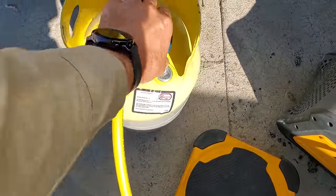Everything is in. We're giving it a good nitrogen sweep, and then we're gonna go ahead and do a standing pressure test, but I need to put actual gauges on for that. All right, TXV's installed, resecured, sensing bulb's nice and safe and mounted back there. I was lucky in that there was enough play in everything to be able to cut it and not have to unsweat it. So it's all good.